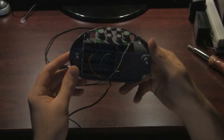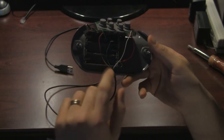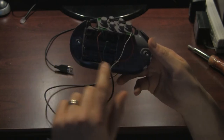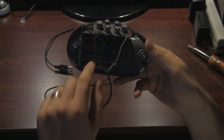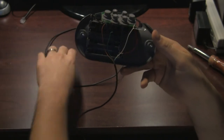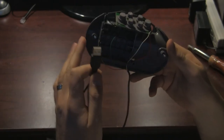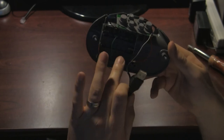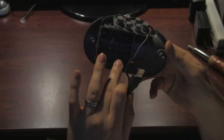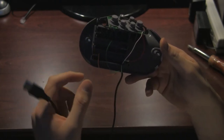There are a couple of tips I still want to mention. You do not want to have batteries in here when you have this plugged in. It will cause the batteries to explode because it will feed power back into the batteries where they should be feeding power into the system. So if you've got this plugged into a USB port to power this unit, do not have batteries in here — leave it empty. Even rechargeable batteries have the chance of overcharging and causing a fire, so I would highly recommend against that.